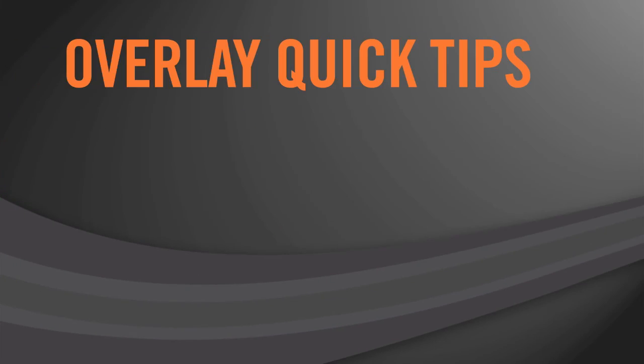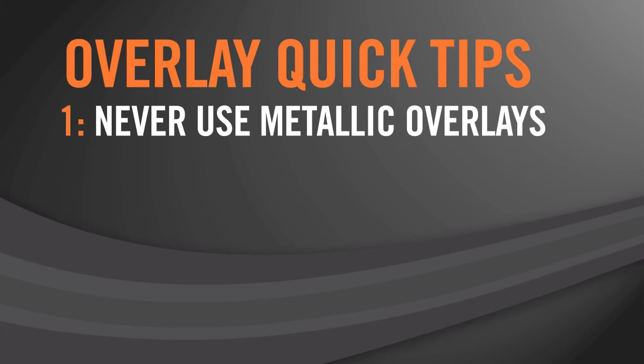And finally, I'd like to talk about a few overlay quick tips. Number 1, never ever use metallic overlays. SMSC recommends a non-metallic overlay with a dielectric constant of between 2.0 and 3.0. This will ensure that your design is effective and robust.